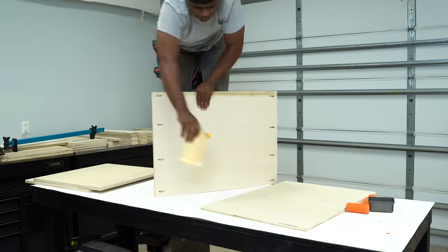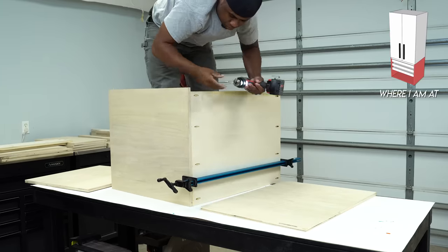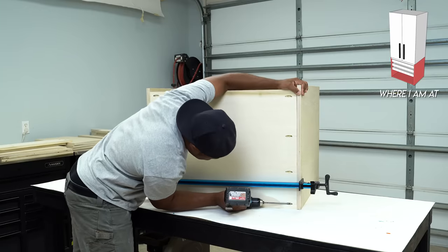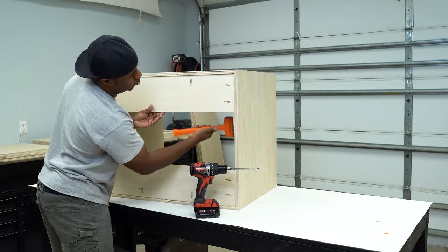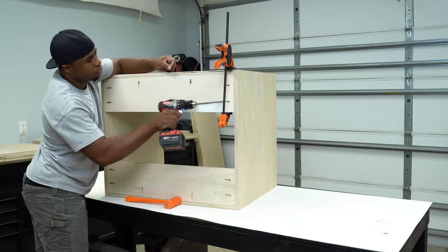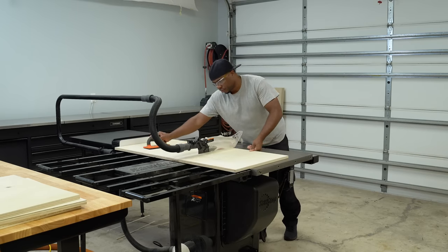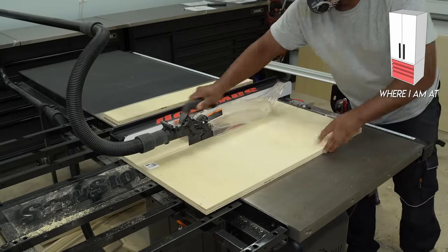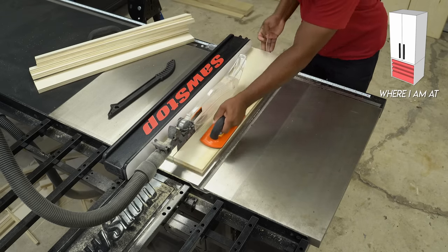At this point I have the sides and bottom joined together, now I'll attach the top. Adding the top and bottom panel to the back of the cabinet not only provides a mounting surface, but also helps keep the frame squared. The lower cabinet will have a total of four drawers in two different sizes. At some point I'll be painting the cabinet, so the grain direction in the plywood is not a big factor for me. So I'm trying to avoid cutting into a new sheet of plywood while using all of the existing cutoffs.